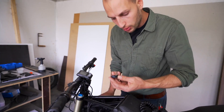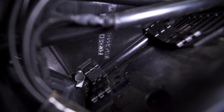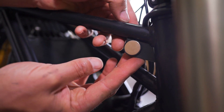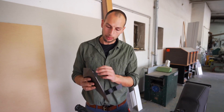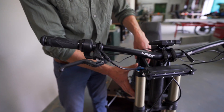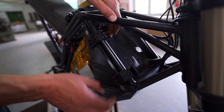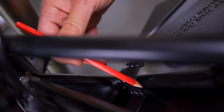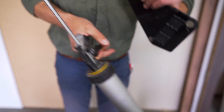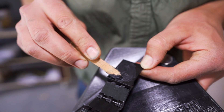Next I'm fitting these magnet holders that go to the other side of the door and will be part of the frame from now on. I'm clipping those magnets on and making sure everything sits nicely. I'm going to be gluing the hinges first — I want to test that everything moves nice and easy, and when I hold one in I can see it nicely wraps around. Aiming for this edge to be roughly parallel with the frame edge. The thin layer of mammoth glue does the job, and with this kind of thick glue I always spread it a little to decrease the gap between the materials.